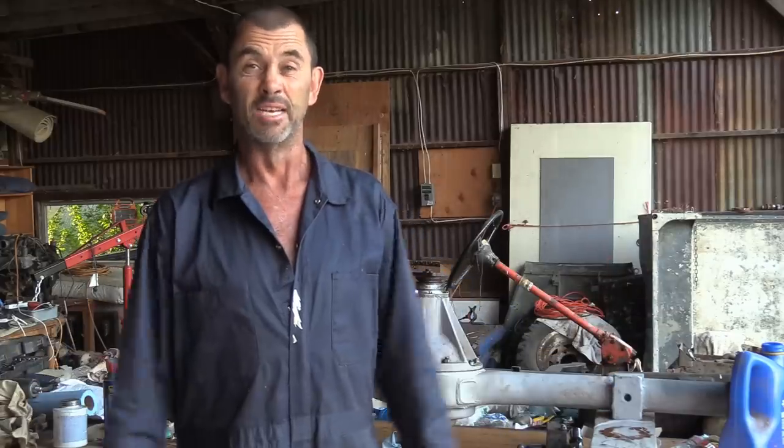All right, I'm going to put this axle housing on the ground, torque up that castle nut to 85 foot-pounds, and we're done. In the next episode is going to be the rear end reassembly. We're going to put it all back together: the springs, the axle housing, we're going to put on brakes and hubs and even the wheels. So join me then for the next episode.